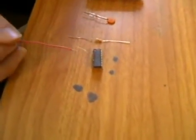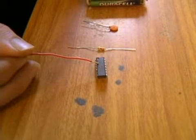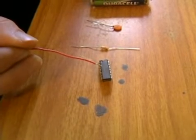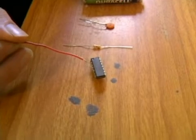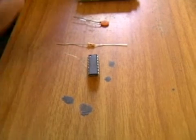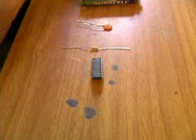Right here we have the chip that's doing the majority of our work. This is a 7414 chip. The numbers that tell you what kind of chip it is are down here on the lower row, and this one says 74HC14. Usually it's 74 followed by some letters, then a number — which is 14 in this case — and sometimes some letters afterward. What really matters is that 7414; as long as you get those right, you have the same kind of circuit.